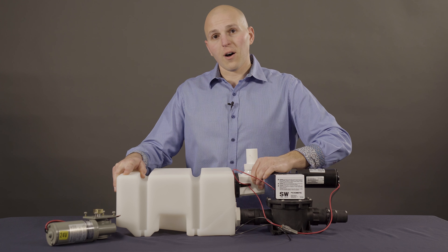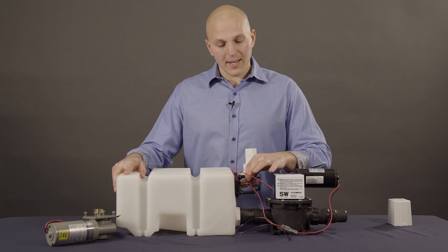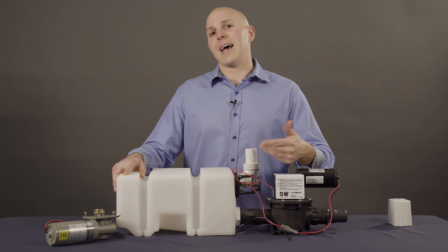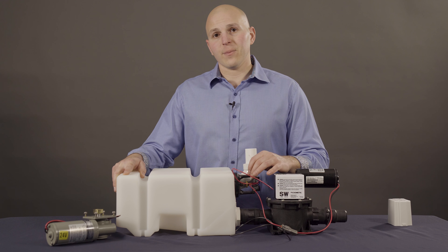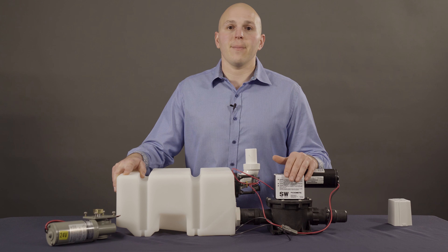The vacuum switch is another maintenance item. It's located underneath this cover. It might be a little challenging to get the cover off — you simply pinch in the middle and put that aside. If you've adjusted this brass nut, unfortunately you're going to have to replace your vacuum switch. These switches are calibrated at the factory, and if your system is not achieving optimal vacuum, it's going to be more prone to issues and cause you headaches over time.